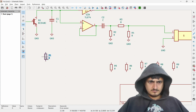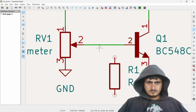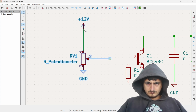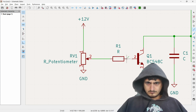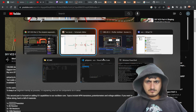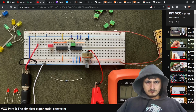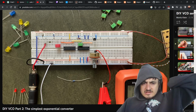Let's just use this one. This way, only a small amount of current can flow, while the voltage at the base is unaffected. If we don't do this, we might see some smoke when we completely open the voltage divider and push everything my power supply has through our transistor. And that's not the most pleasant experience.